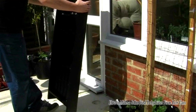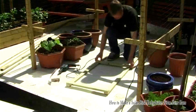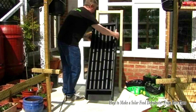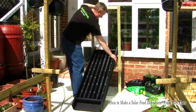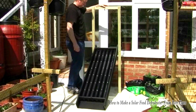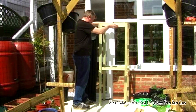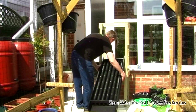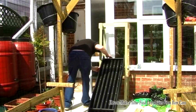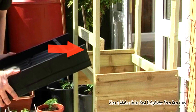So there we have the finished painted product — it still needs a few bits doing to it but we'll get back to that later. In the meanwhile we need to build a very basic A-frame structure, and that structure has to be just wide enough for the width of the collector to fit into it. So a little test fit there, and now I'm happy with that I can go on to build the main frame structure for the dryer. Here we have a very simple basic skeleton for the dryer that's freestanding on legs, and there the solar collector fits into it quite nicely. I've included an extra bar across the top that will form a kind of letterbox arrangement in which the solar collector will slot.